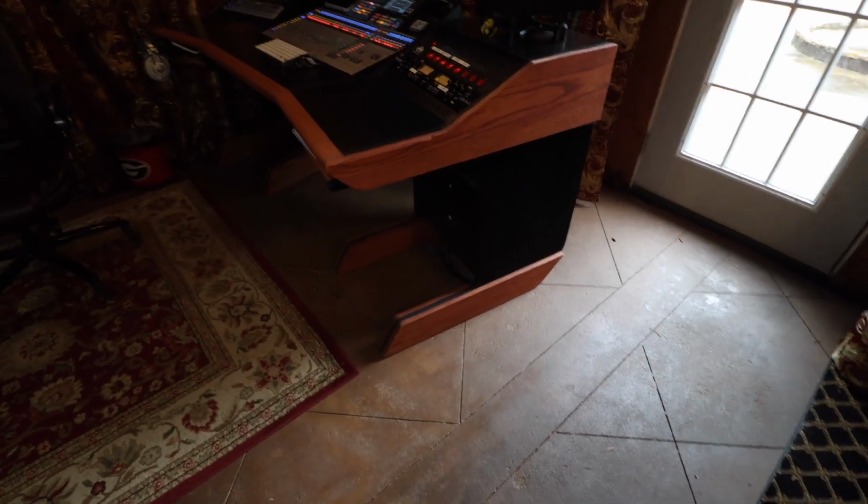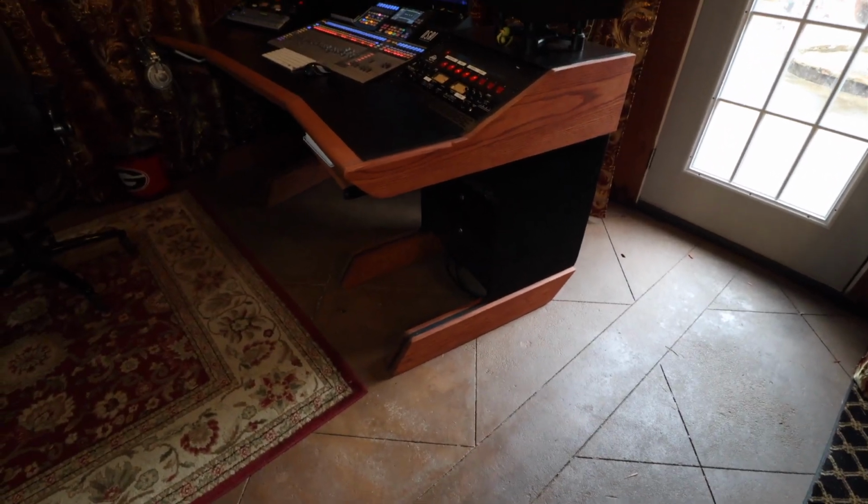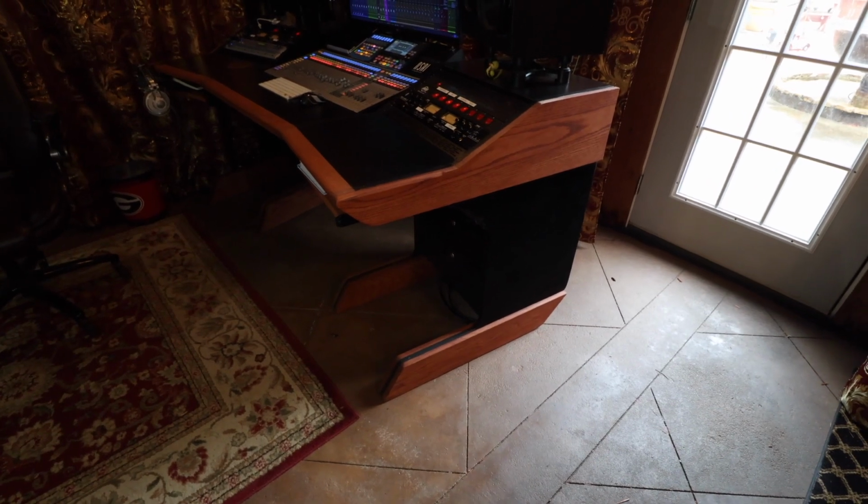Also, these red oak accents that I put on the side and on the legs, there are no screws. I didn't screw them from the outside in. Similar to how I put the second layer of plywood the mixer is sitting on, I went from the inside, where that shelf was, and screwed a screw in from the inside out, so it pulled that down. Then I did the same thing on the legs. Basically, you don't have any screw holes to fill, and it gives a nice, professional, clean install, and it turned out really great. I got lucky when I thought of that, because I almost screwed it right in from the outside in, but I was able to do it from the inside out. So that's another tip, so you don't have screws showing or anything to putty.